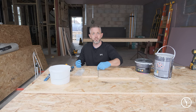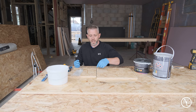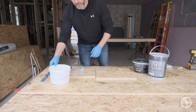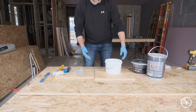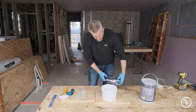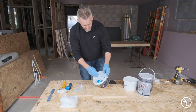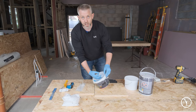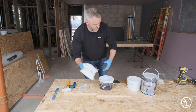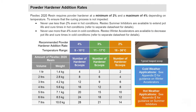When putting in 8×4 sheets, use a minimum 3mm packer gap between boards. On the 2020 system, unlike standard fibreglass which uses a clear resin, we use a white primer — a 5kg white primer decanted into a bucket. On its own it won't go off; you have to add catalyst. When you open the catalyst tubs you'll get two bags of catalyst to decant into the bucket. Note that this can be carcinogenic, so please wear respiratory protection when decanting.